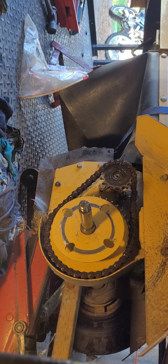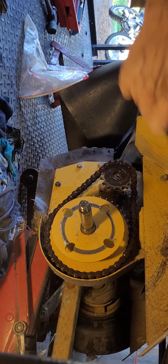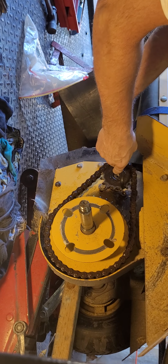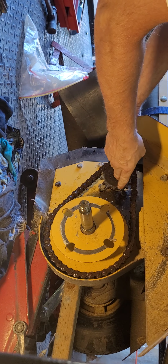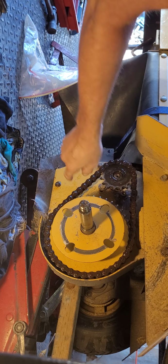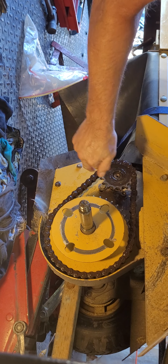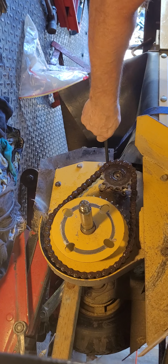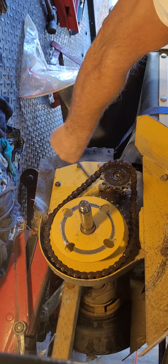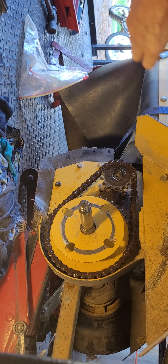All right. Now this is very crazy. Yes, very crazy. So you need a 5/16 Allen wrench, and you'll have to line up the sprocket to get into it. You might even have to push the sprocket back in. Make sure you clean out that hexagon. Believe it or not, there's 4 that hold the motor at the back, the hydraulic motor. So the 1, 2, 3 are 9/16, but this one is a 5/16